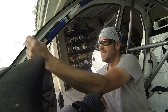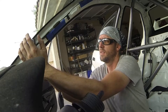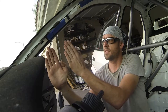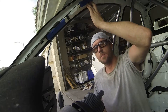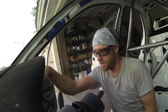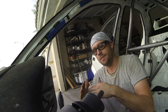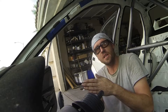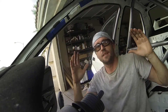The best way to figure out the offset is to take your protractor, hold it at 90 degrees, and turn it inward to the point where it just starts touching the A-pillar — and now we have a 10-degree offset. So we know this is 20 degrees up here, we know we have a 10-degree offset, and since the lower section has to be parallel with the main hoop, in a perfect world we'd have a 70-degree bend going through the dashboard. I'm going to go a little less — start at 60 degrees — because we can always bend further if needed, but you can't unbend a bend. So: 60 degrees down here, 20 degrees up here, 10-degree offset, 6-foot tube. Let's get to cutting.